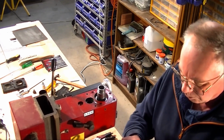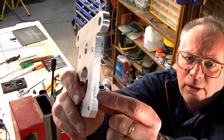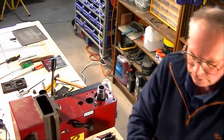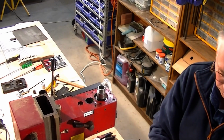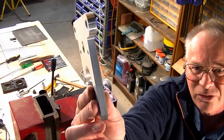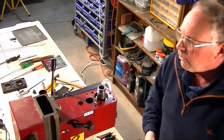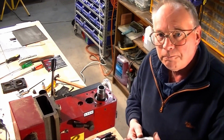to machine something like aluminium, I don't know whether the light's picking that up, but you will get some chatter there like that. When the machine is moving in the Y direction, it's noticeable; when it's moving in the X direction, it doesn't seem to be quite as noticeable. But it's a pretty good finish, well, there you go. So I'll put this together, and then we'll screw it on the top here.